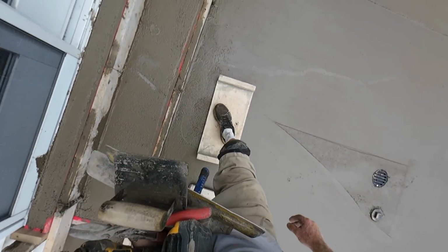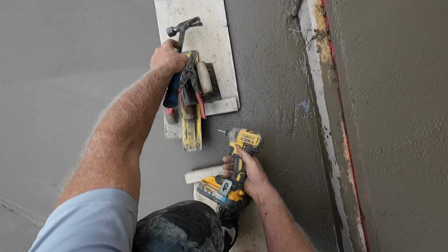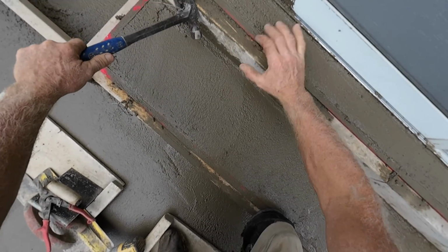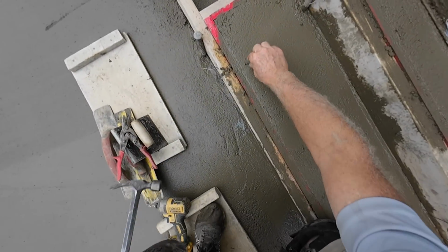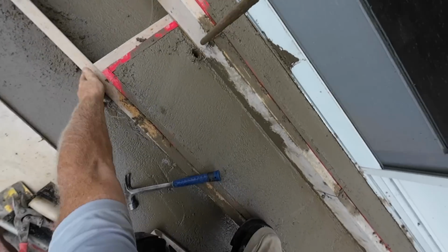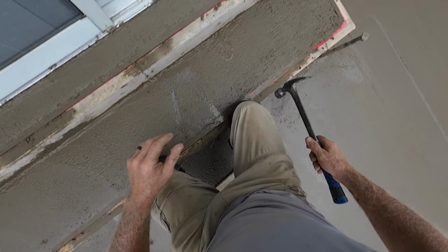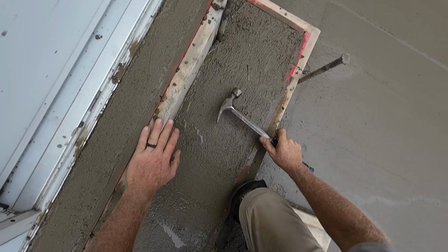Okay, so we use knee boards because our sliders just dig in so much. First things first, pull our pins. Everything's nice and gentle. We poured the steps first, and we used really tight concrete, so this is firm and should hold. Always tap these, so when you go to use it, the holes are open. Side to side, away from the step.